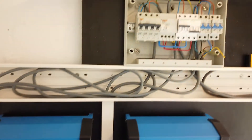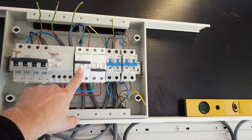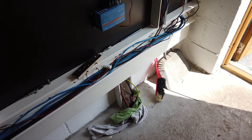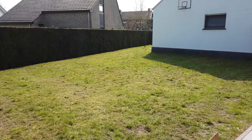AC out of the MultiPlus goes to this breaker box, which I still have to finish. With only one MultiPlus active, this cable goes into the AC cable gutter and runs underground following this path to the garage. I made this setup several years ago — the 18650 battery powerwall has been in service for about three to four years. I already foresaw one cable towards the house: three cables of 2.5 square millimeter. When you design something, make sure to foresee four square millimeter so you can handle much more load in the future.